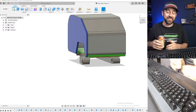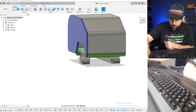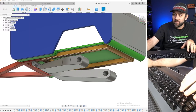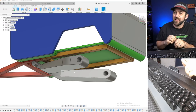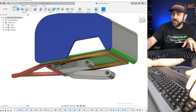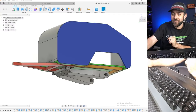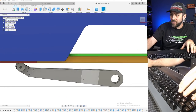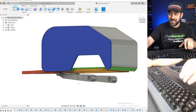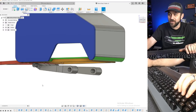I'll take a break to read the comments. I'll also make a leaf spring version of the base so you can bolt leaf springs in easily. But the first one will be trailing arm suspension — coils over leafs every day. On printing TPU leaf springs: TPU is more rubbery than springy, and that's not what you want in a leaf spring. I think you'd be better off with PETG over TPU for sure. If you were going to use TPU, you could print more of a cavity-type spring as a coil replacement, but it's not the right material choice.